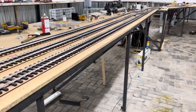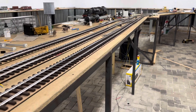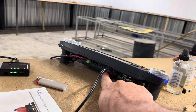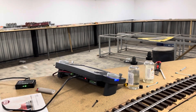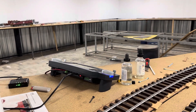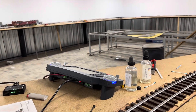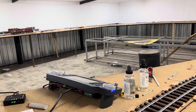Now one of the guys asked, as he's new, let me explain how a booster works. A booster is a very simple thing — you couple the booster so that you have the digital signal. Everything that happens on your controller gets put through to the booster, so when a train goes over to the booster sections the signal from your controller gets picked up by the booster and the train carries on fine, because the booster and the controller speak to each other. The controller tells the booster what to do — what train is going over there, what speed, what sounds.